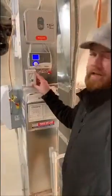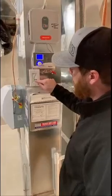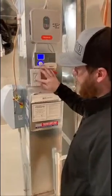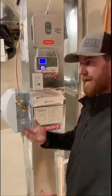We've got the control for the ERV air exchanger. It's got numbers from 10% all the way up to 100% — click this button to change it. Typically you want to stay in that 40% to 60% range, because this is what's cycling in your fresh air and taking out the old.